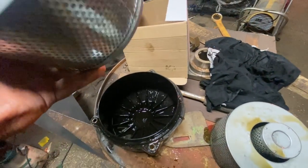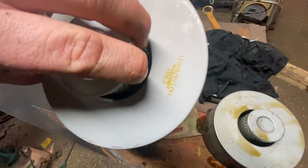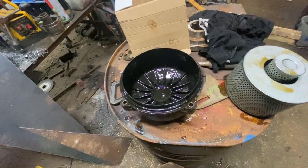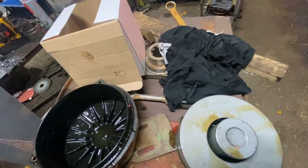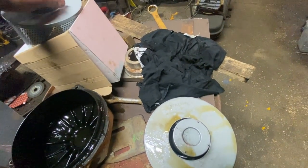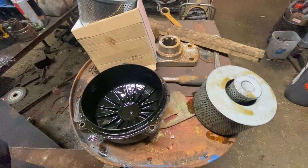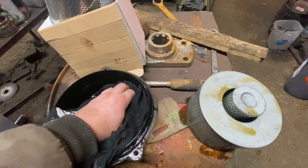All is good here. Ready to stick her back together and put fresh oil in. I have my new filter here, and I always use genuine ones. I feel it's important to put the genuine stuff into these. So I'm going to stick this filter back in. There's also a pressure filter that we need to change, and that's underneath it.